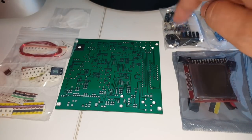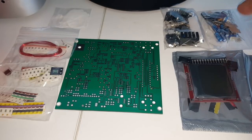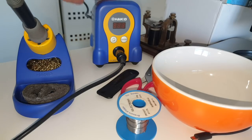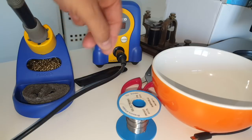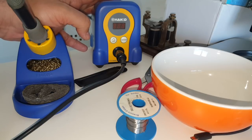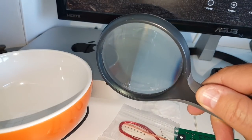You also have the heat sink, jacks, antenna encoder, capacitors, and toroids. I'm using a USB microscope, which is very useful for integrated circuits. A flashlight helps read tiny markings on components. I have my Hakko temperature-controlled soldering station, tweezers, thin solder, and a white plate. Normally you'd use a hot air gun and a heating plate, but I don't have one. A big magnifying lens is also indispensable.